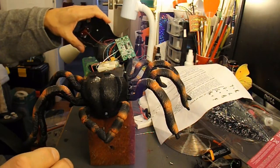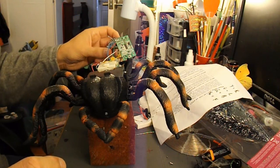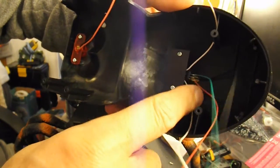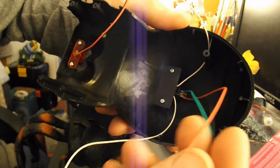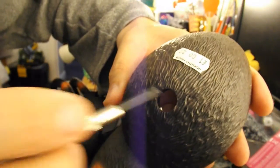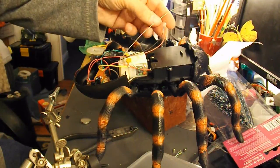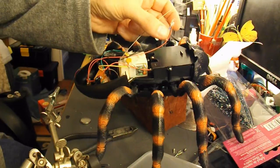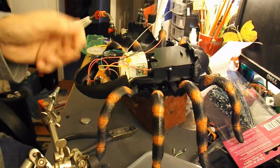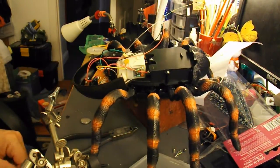What we don't have is any flashing LEDs or lights, so I need to work out if there's a chance of connecting anything up there. If there isn't, we'll just have to go without. One of the bits we don't need in the Spyder anymore is the infrared receiver — or the infrared detector — so I might as well take that out; that will be useful for other projects. And that then leaves us with a convenient hole for the antennae to poke up through. I've wired up an LED so it comes on when we actually switch it on — an LED with a resistor in circuit, just so that I know that I've left it switched on.